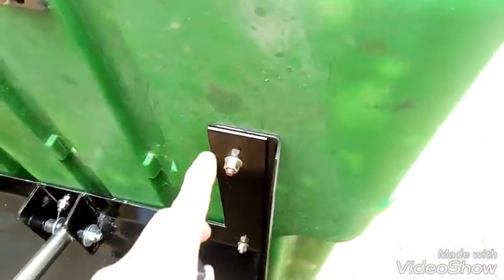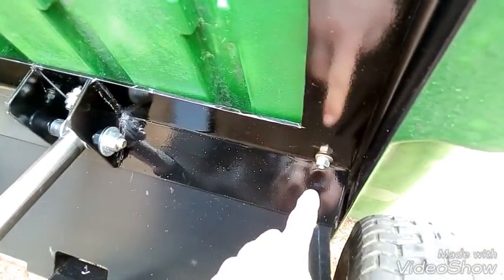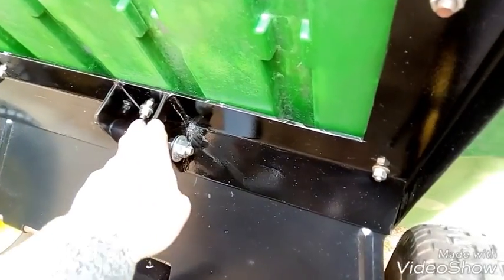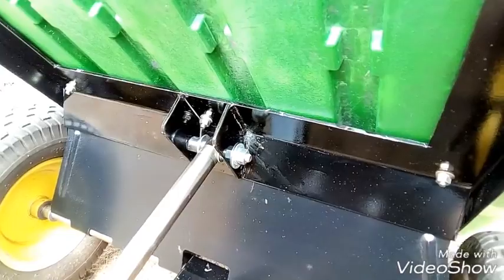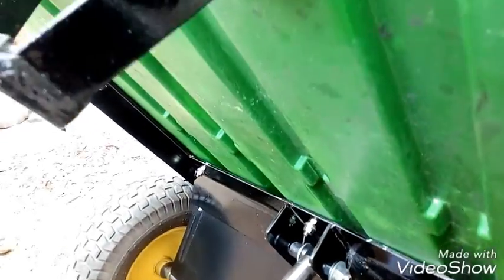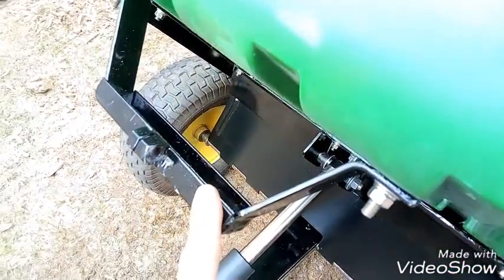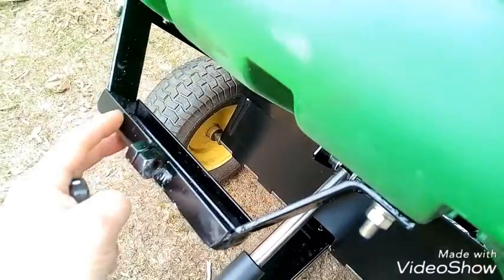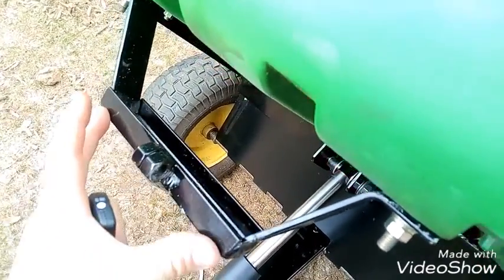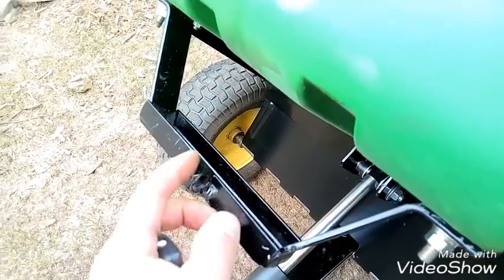So here is the reinforced bracket that I have made. I had it bent at a shop here, and then here's my gussets there for how it's attached to the linear actuator. And then I had to chop and modify this, and I used a small angle iron so that when it's resting it doesn't push up in, because that's quite a wide span, so I wanted it to be strong.